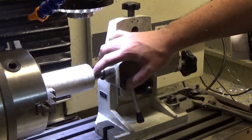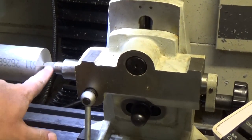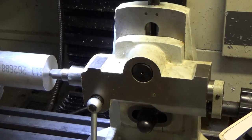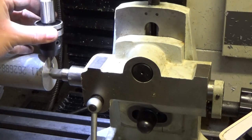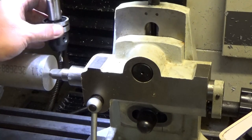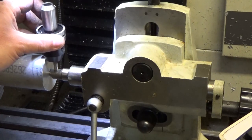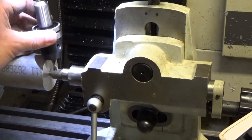The difference between a dead center and a live center is that this one doesn't rotate — a live center like on a lathe has ball bearings and rotates with the part. This is called a dead center, and the reason you'd want to use one is because you want an area where there is no material — no steel — so in case you want to machine in that region the tool won't clash with it. We're not gonna be machining in this region here, so it's fine either way, but just for safety I'm gonna put it on top in case I have a bug in the software.